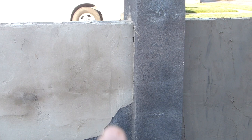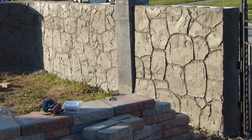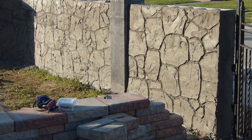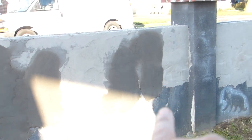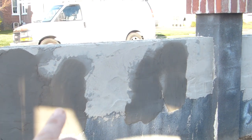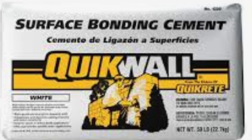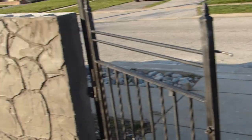So I get my finger in there — it was over here also — and now this is a base going on, so more will go on there. When I put the final three-quarter to half-inch product on, I carve it out to look like stone, then mortar up the joints. The wall went up two more blocks, so I used Quick Wall to tie it in with a fiber product that bonds the two surfaces together and reduces cracking significantly.